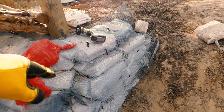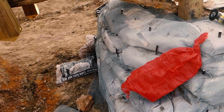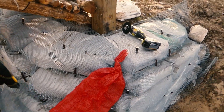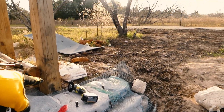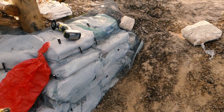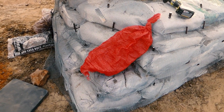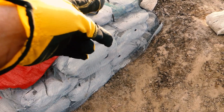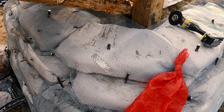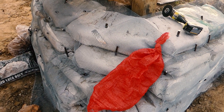Anywhere there's a little flop I put a piece of rebar in it. I'll mud it all up, put in the stones - similar to the other side but a different design. This one will have stones here and kind of wrapped around there. I might have to cut some things out with the grinder just to make stones fit. I'm prepared to do that. Down on the bottom I've decided to pour concrete along the first row just to tuck that in and let it cure. I might get that done tonight just to have a running start for tomorrow.